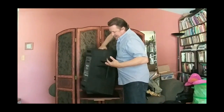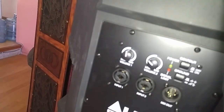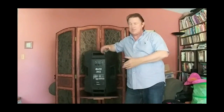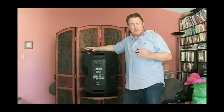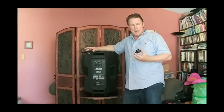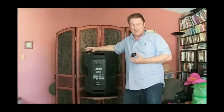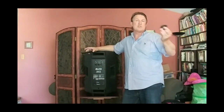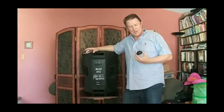Some people tell me that if you don't turn the gain up past 12 o'clock, that will help. But it doesn't make sense to me — whether you're turning it up at one end or the other, as long as it's not distorting, this has a protection circuit with a little light that goes on when protection activates, so it shouldn't be blowing tweeters. I ordered replacements from Full Compass online — they had the best price at about $28 each. I bought three since I blew two, figuring I'd stock up. Shipping was only $8 for three versus $6 for one, so it made sense to spread the cost.